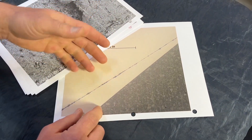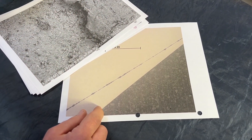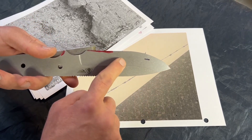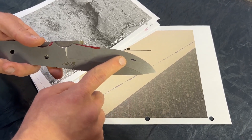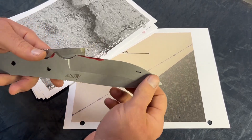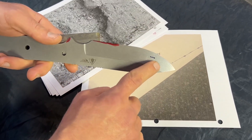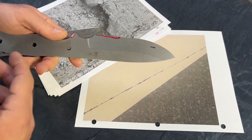You can see it in my finish grinding as well as we broke into that, and bevel grinding at different stages before finishing. But then in finishing, that's just our last chance — if there is anything soft, it'll just tear out because it's not hard like the rest of the alloy. People ask why other companies aren't seeing it — a lot of finish methods will not make stuff like that obvious. If you're just going to throw these in a tumbler or something like that, it just grinds at it, and you don't necessarily see all that until later under use and weather gets at it — it'll just come out. And some people have said that they have been seeing it now that folks know what they're looking for.